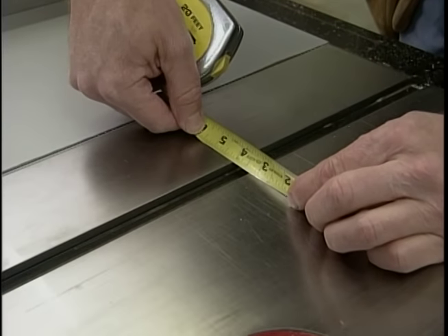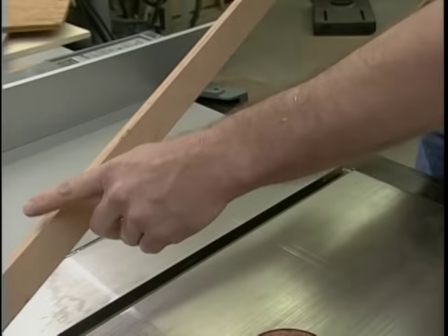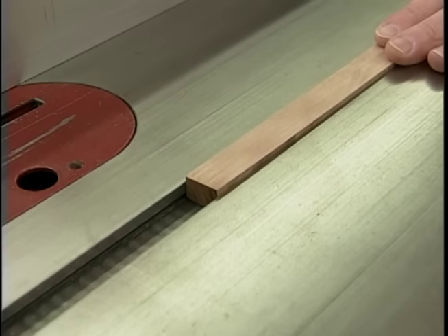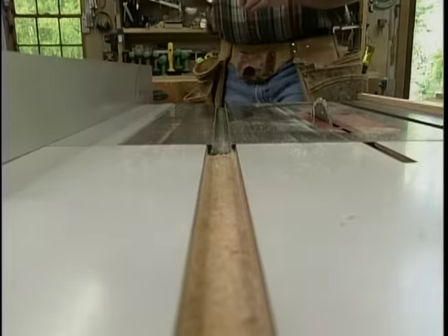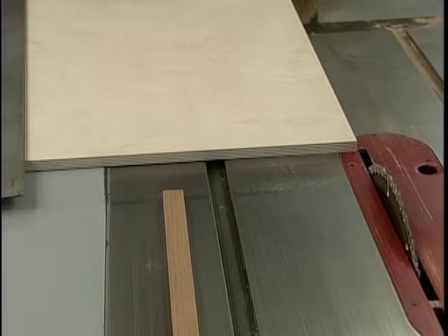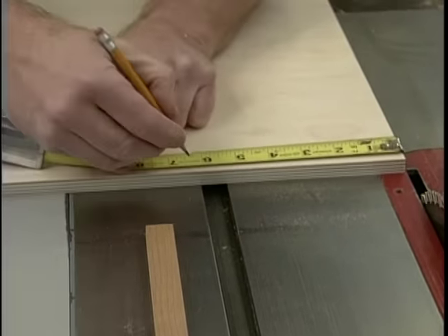The slot will vary slightly from saw to saw. This one is just a little over three-quarters of an inch. So I have a piece of cherry that I've jointed one edge and we'll rip a strip. It's still just a little bit tight, but I think with a little lubrication it'll be fine. For the thickness of the runner, I don't want it to be proud of the table surface, yet I want to get it as far into the slot as possible — that looks like about three-eighths of an inch. The next step is to locate the strip on the plywood bottom. The distance from the saw blade to the slot is five and a half inches. I'm going to put a mark at six and a half inches, and I'll trim the end after the runner is installed.